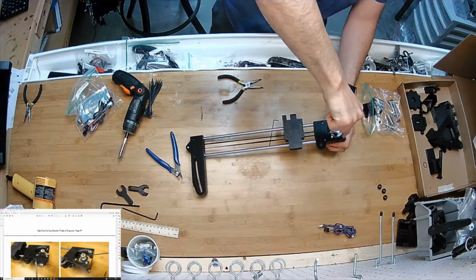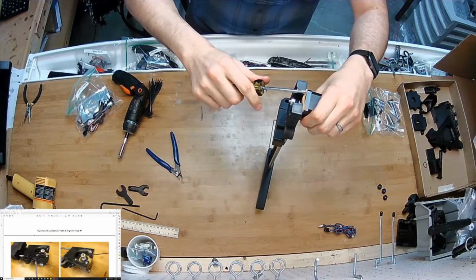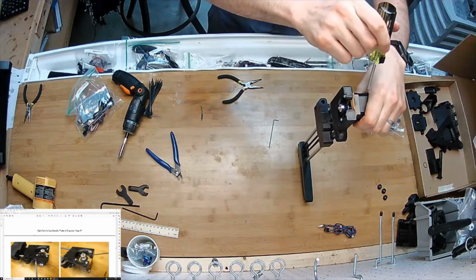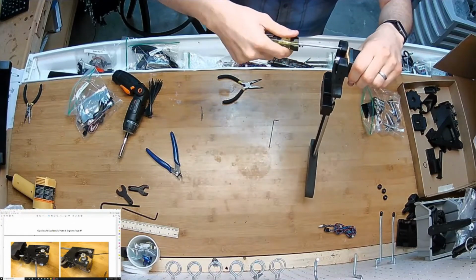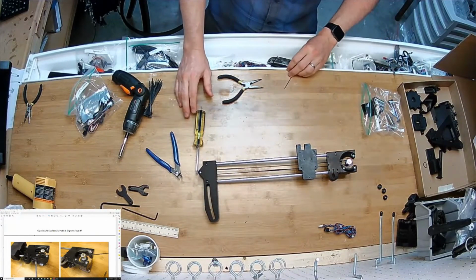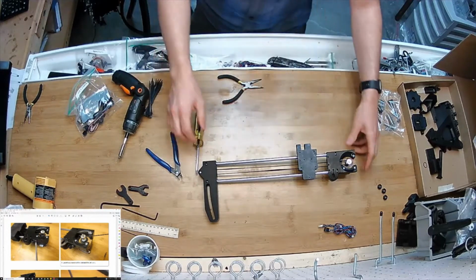Tighten those snug. It's hard to pick a torque on that. It does a cork thing in there. It's serving the function, its intent is to dampen noise and to keep just a heat buffer between the metal and the plastic, just in case. Plastic has a property called creep where it can deform really slowly over time, so that's kind of what I was trying to avoid. I haven't observed it in this project.